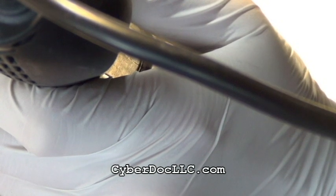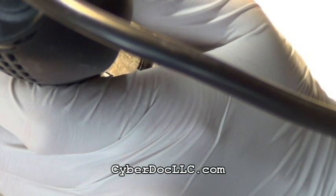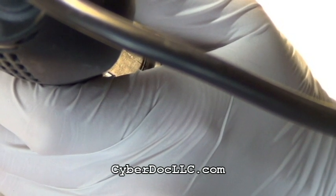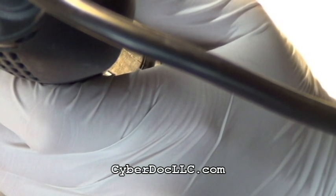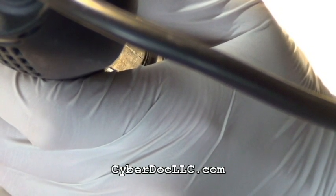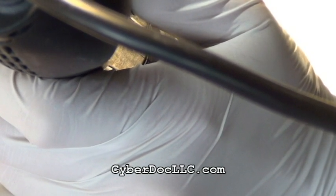Your heat gun and this heat gun are not going to have the same profile. The important thing is you don't want to go over 300 degrees Celsius, because that will start burning off the parts on the board. The logic board from Apple is designed to withstand up to 300 degrees Celsius. So it's not going to be damaged at 300, but if you go out to 400 degrees or 350, there's a chance you might start burning off stuff.